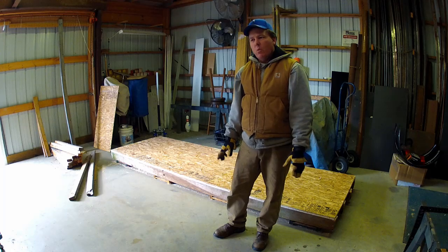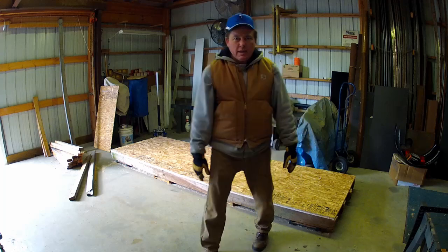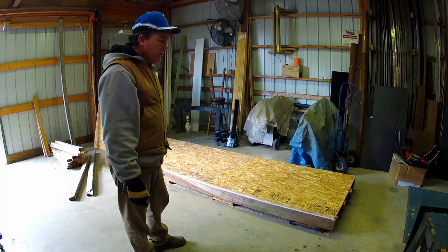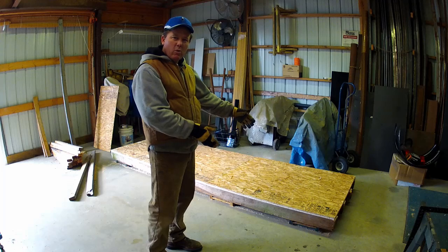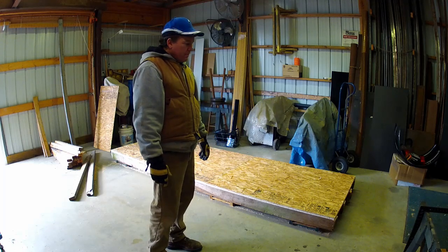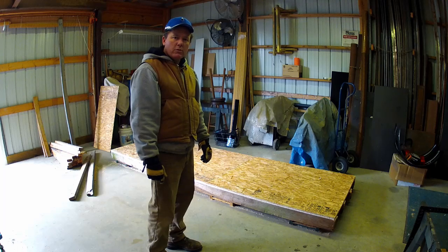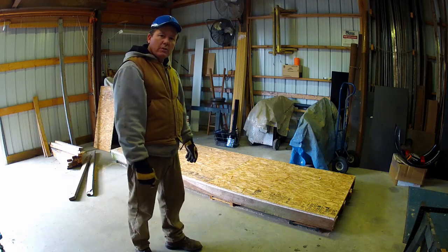A lot of this is going to become what you need and what you want. In my particular case, my boards are about 9 feet. This is about 11 and a half, almost 12. I wanted 4 feet inside because I figured my stack could be about 3, 3 and a quarter by 2 or 3 feet tall. That would give enough room around it for air circulation to put two fans, as well as my heat source for setting the pitch. So it's about 4 and a half by about 11 and a half right now.